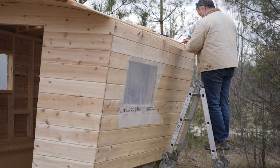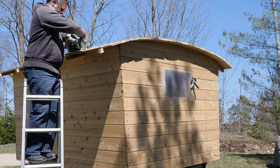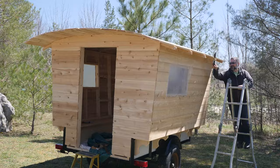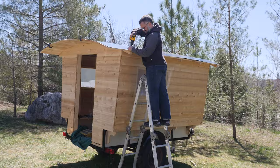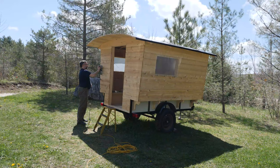I got some flat stock steel from the same Amish supplier I got the cedar paneling from. This is the same type of steel normally used for steel roofs — usually they add some forming to it, but I wanted it nice and flat on the roof of the tiny cabin. I used a silicon adhesive between the steel sheeting and the cedar wood paneling to help prevent any water from seeping in from the edges and eventually flowing through the tongue and groove boards and getting into the camper.